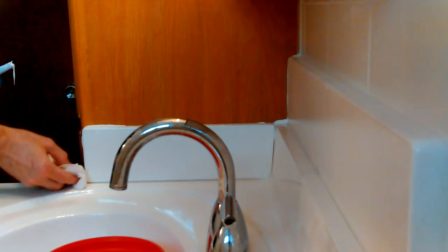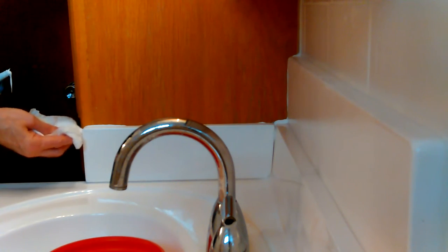I'm going to put pressure on it to squeeze all that stuff on the back good. Because of the way the sink - the edges are higher and it's not level so that it will drain, which is great, but it's going to cause me to have more area of caulk. Just want to make sure I don't stick it out too far away from the cabinet. I think that's as far in any direction as it's going to go. I'm getting caulk in this brand new sink - we don't want that.